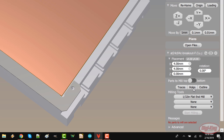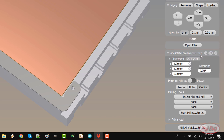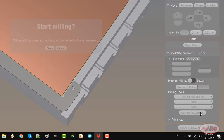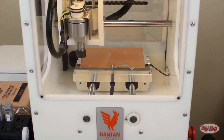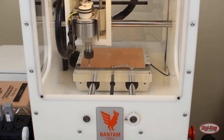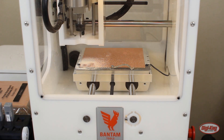Back in the software, deselect holes and select outline. You're welcome to use the 1/8 inch end mill here if you've got one, but I like to keep the 1/32 inch mill for routing — it's one less tool change, and I find that routing with the 1/8 inch mill makes a rather large mess. Click start milling and OK. Because we didn't need to change the tool, the machine should immediately start routing out the board. Once the routing is complete, vacuum out the debris.